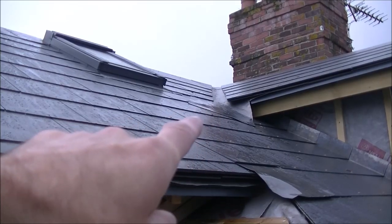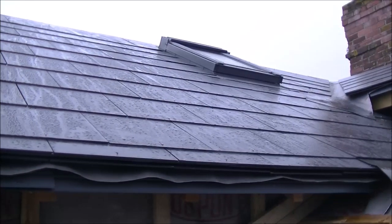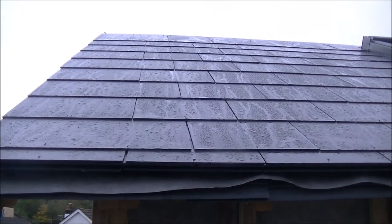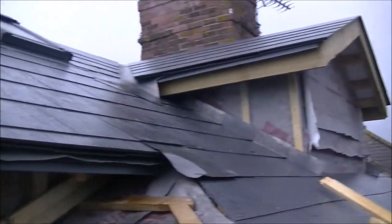Just to show you up in the valley — I haven't quite finished the top row of slates but I just managed to get all the slate work up to the top, so it's going to help this water come down in this disgusting weather. Obviously that Velux is done, you saw me do that in an earlier video. And I've done the slates all the way across the top — I've got to do the top row still but at least the felt has got some coverage now. All we're left with now is this hipped area here and basically the cheeks of the dormers. Because we're in October it's getting a bit icy now, so I just want to get the slates on this roof, all the ridge tiles, get the fascias and gutters done, and then we can have a rest and get on with the interior.